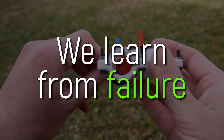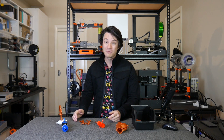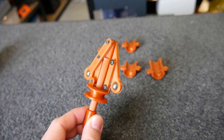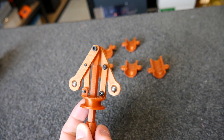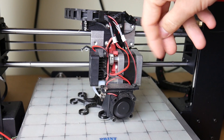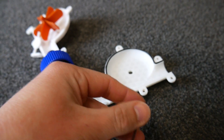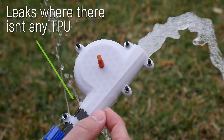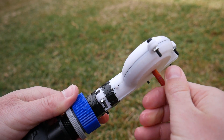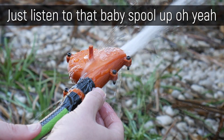At the start of this video I said that even failures can be good, and they are. Even though the final design doesn't really work as intended, I learned lots of things. First, you can actually 3D print a working mechanical governor — this thing works as intended, even if the mechanism it's attached to doesn't. I also learned you can 3D print o-rings using flexible filament. I used the Cocoon Create fitted with the Flexion extruder and printed with flexible TPU — it works really well. If you wanted to make a sealed electronics box with FDM, you could inlay 3D printed o-rings of any shape, which I'll definitely use in future projects. I also found it surprising just how lubricated these shafts can become when water is actively flowing through them — there's no bearing in here, but when it's wet and running it can spin very freely.